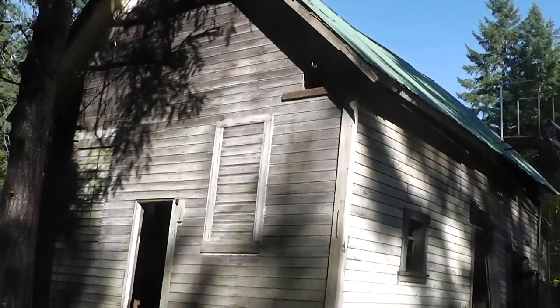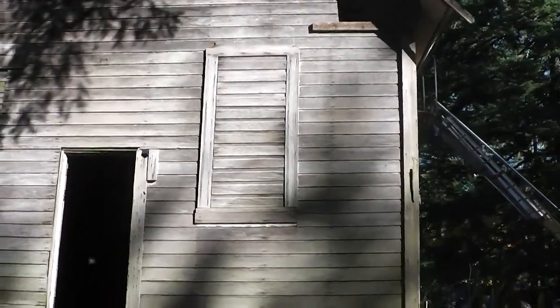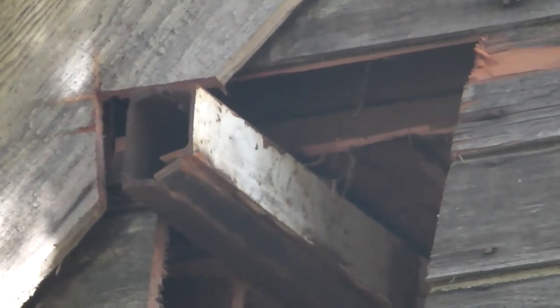The beams are a little longer than the house. We expected them to stick out, but didn't expect them to stick out that much because the whole house has a tilt to it — about a foot out at the top. We'll jack the house straight up and rebuild the walls straight down from the roof, so the house will basically jump to the right one foot. The beams weigh about 400 pounds. They're made out of two pieces of C-channel welded together, and the end sections are made out of all kinds of stuff welded together — that's why they look strangely shaped.